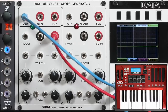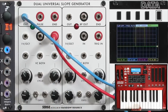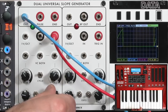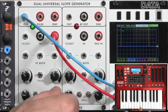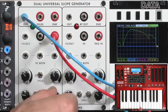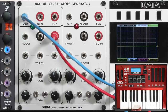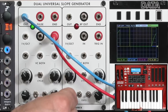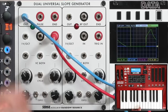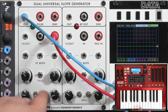Starting with the classic shape on the fall, I take the knob off center to get an exponential release. Changing the feedback path through the voltage control changes the time, so I need to slow it down to compensate. Going the other direction gives a logarithmic decay — quite an unnatural shape, but potentially interesting. Putting the switch into the down position gives an alternate shape where it dives to the bottom voltage at a different angle.